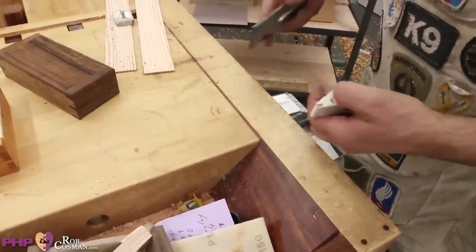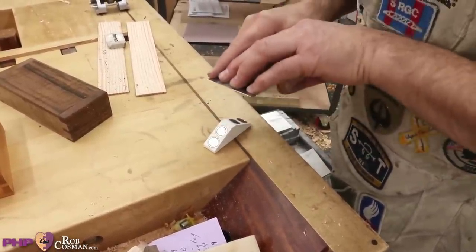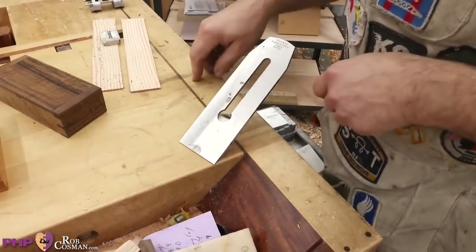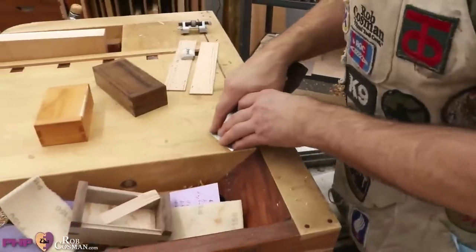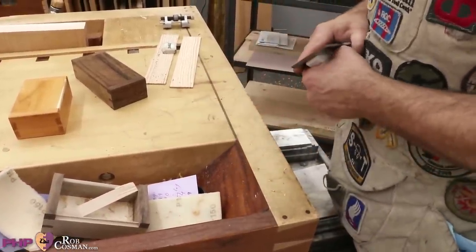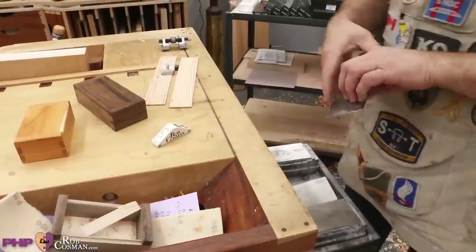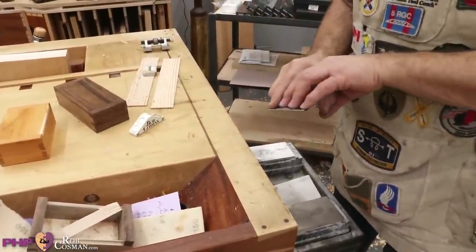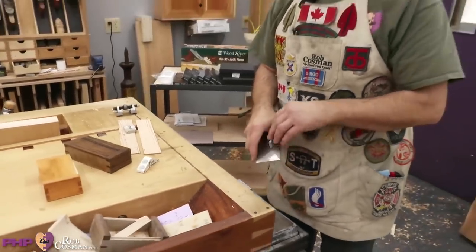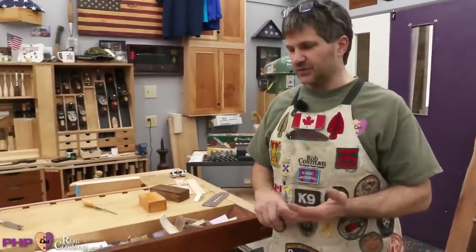So you're going to do the same motion you would if you weren't using it. When you go over to the fine stone, you turn it over to the 31-degree side, and now you hold it the same way you would if you were freehanding. Engage the magnet, slide it forward. Now you're up 2 degrees higher, and you're able to go in, do your tertiary bevel, downward pressure in one corner, downward pressure in the opposite corner. And in a month's time, this thing is going to wear out anyway because you're running it over a stone. Well, when it's gone, you don't change anything. You're still holding the blade the same way. And by then, you should have gotten comfortable enough that you can now do it freehand. And you have developed a skill that will speed up the process of sharpening.